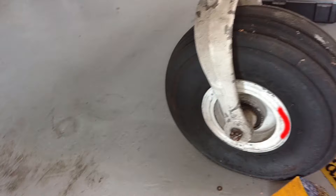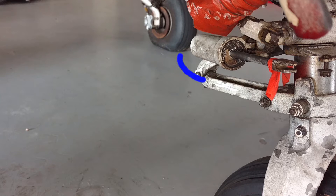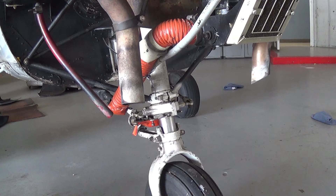And lastly down at the bottom here we can see our whole nose gear assembly. We have the nose gear fork, the tire, the wheel, and of course the shimmy dampener. Those shimmy dampeners do lose fluid over time and need to be serviced. That's when you notice — when you release the controls after landing and the weight falls onto the nose — it shimmy's like a shopping cart wheel going crazy, and then you pull back on the controls, take the weight off the nose, and the airplane tracks nice and straight. That just means your shimmy dampener is a little worn out, or maybe some of the connections in the fork. You can see these two rods that connect to your rudder pedals — that's what gives you the steering input left and right. As those little grommets wear out you get free play and tend to get that shopping cart wheel effect. Pretty cheap to replace those — just have your A&P take a look at it in the next annual.